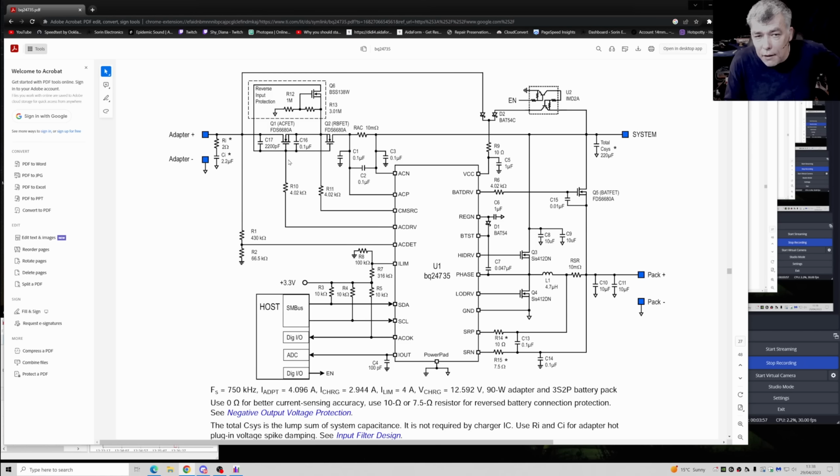Now on the gate, yeah, you see the gates are together. We have two MOSFETs here, the gates are together, and they are managed by this pin, yeah, ACDRV, okay? Now I have seen in the past many people said, sorry, how can you have 26 volts on a gate? Because of this pin, yeah? Not 26, actually it is 6 volts over the 20 volts main power rail.